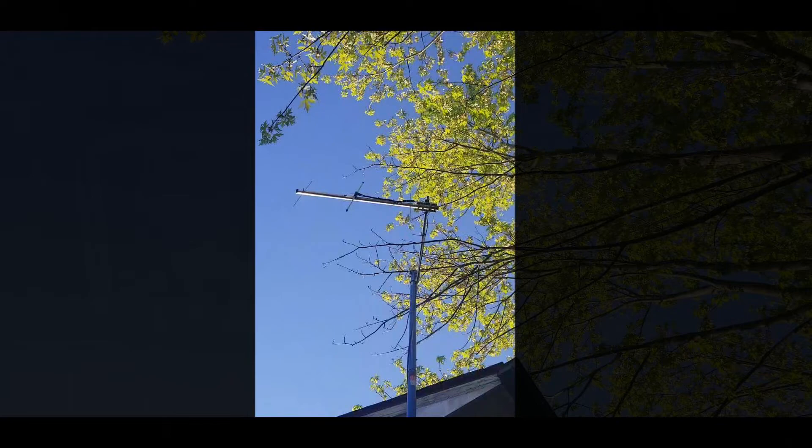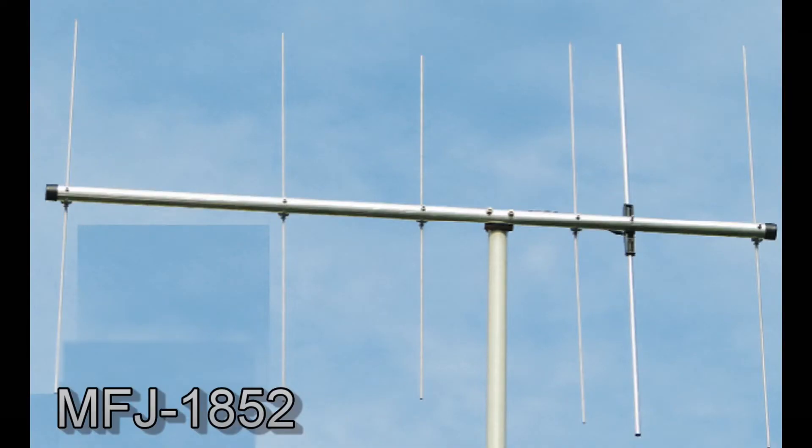It's just been a personal challenge of mine to see if I couldn't set something up where I might be able to check in with an actual radio. So I have already ordered a 6-element Yagi — a little bit more gain in the forward direction. I'm going to try to get that put up using 6 of these 6-foot poles, which with the overlap would probably get me about 33 feet in the air. Hopefully a little extra height and a little extra gain with this new antenna, the MFJ-1852, will let me directly communicate with the repeater and participate in our nets.